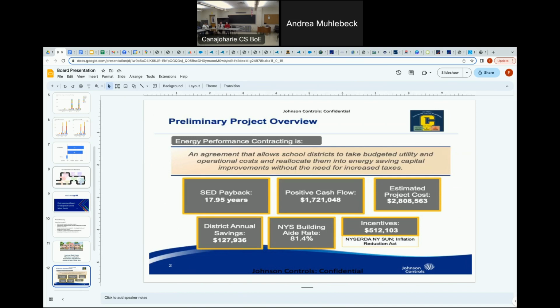The other proposals are for the hill, which is where the original proposal was, behind the baseball field. And I also had them look at the triangle between Carlisle and Cunningham behind the baseball field, which to us is unused land. But the hill requires site modification. The hill's interconnection is from that hill all the way to behind the maintenance area at the high school. So you've added considerable cost in trenching and running cable service from the hill to here.